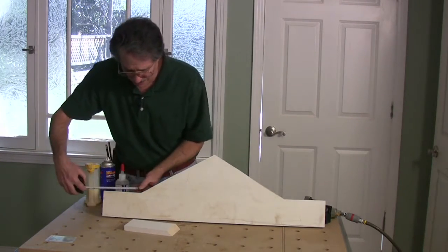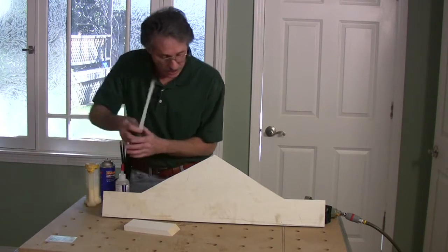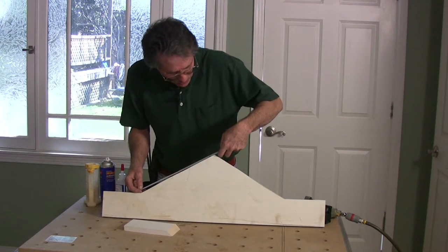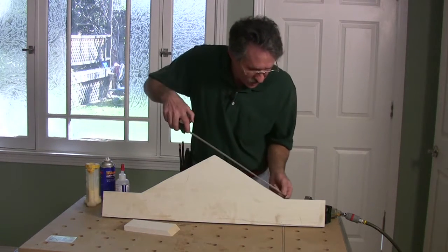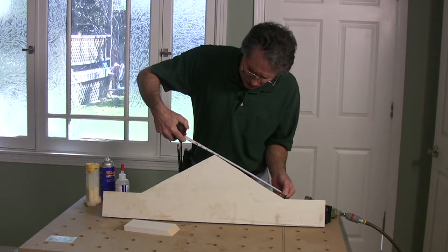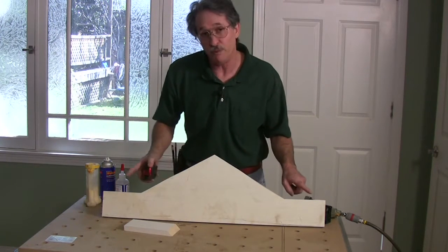This piece here, we know that one's 2 inches further than the wing. That would make it 8 inches. And this, we figured the math pretty closely on this. This piece should measure 12 and 11/16. And on this side, it's 12 and a strong, almost just, it's more like 5/8, but let's make them both 12 and 11/16. And that way our joinery will be perfect.